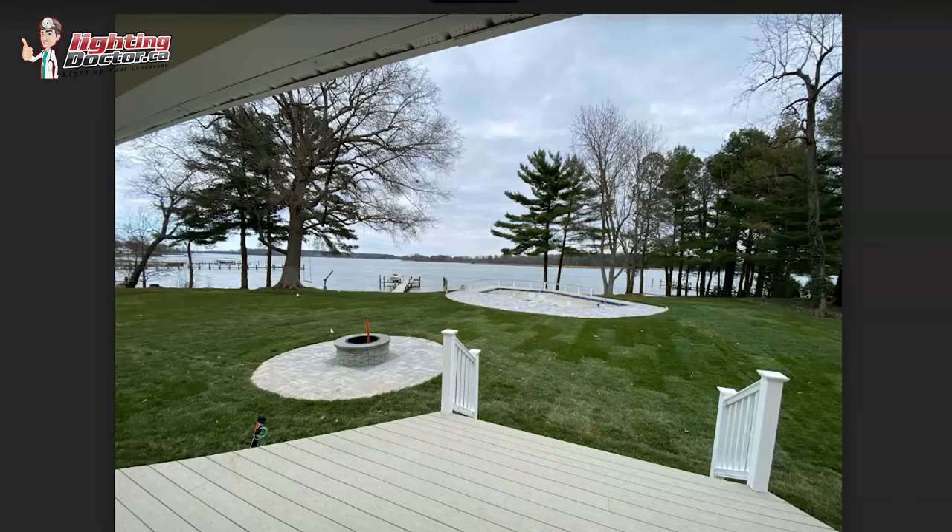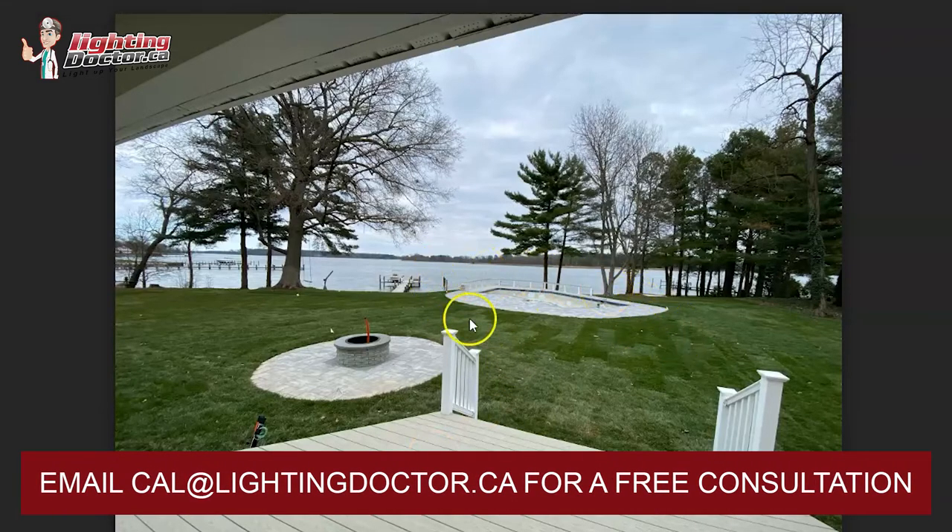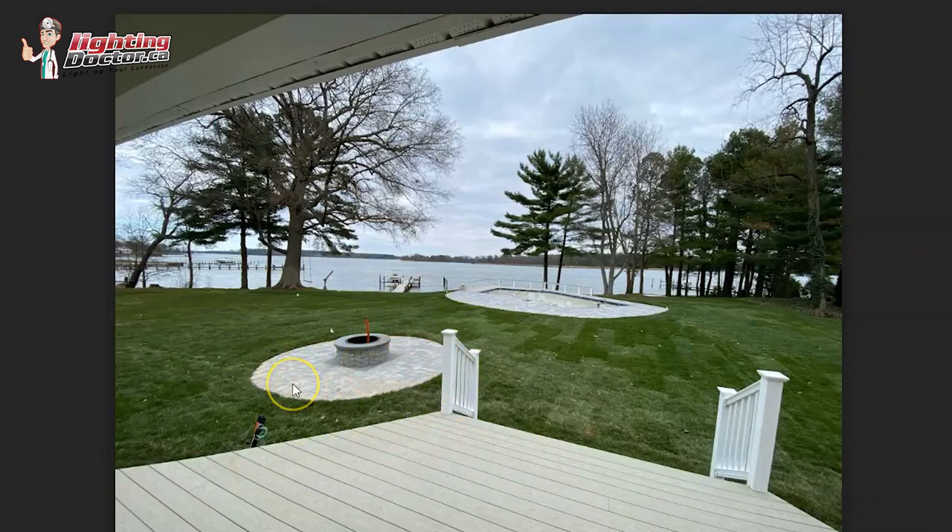If you're doing anything around the pool, something I like doing — especially if you have concrete all the way around — is if you plan on putting flowers or anything there, you can put a path light with the wire run up through the drainage hole so it's pretty much hidden. You can mount a light there, leave a little extra wire so you can move it, and it won't be right by the pool. You don't have to worry about looking up into it while swimming, but it creates that visually stimulating look around the pool.